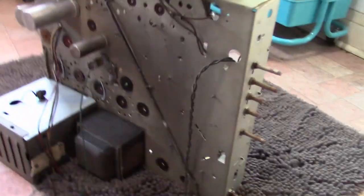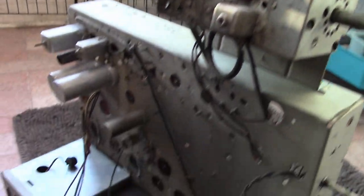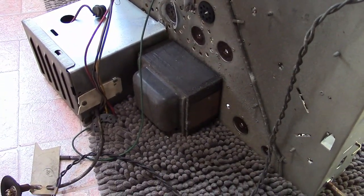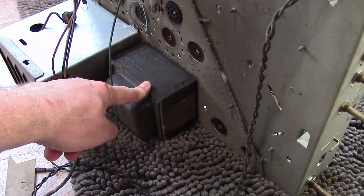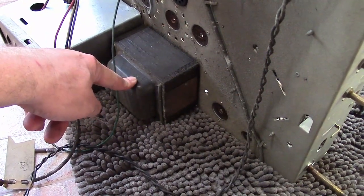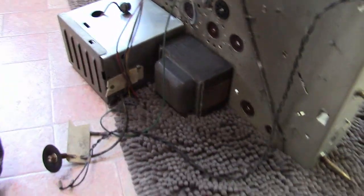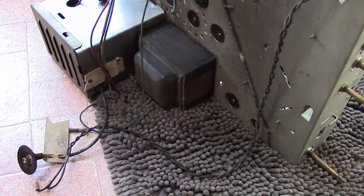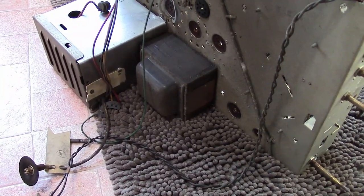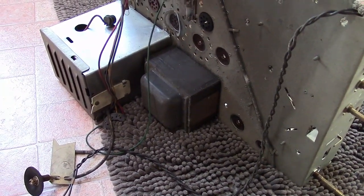Now let's get to the chassis. There were a few bolts underneath — removed those and just slid the whole thing out. This is transformer-based, so one thing you might very well want to save is the power transformer. This had quite a few tubes in it, so there's going to be a healthy filament supply, probably 6.3 volts at 10 amps or something in that ballpark. And then there's probably going to be one or two secondaries, with one for sure being something in the neighborhood of 500 to 700 volts center-tapped at several hundred milliamps.